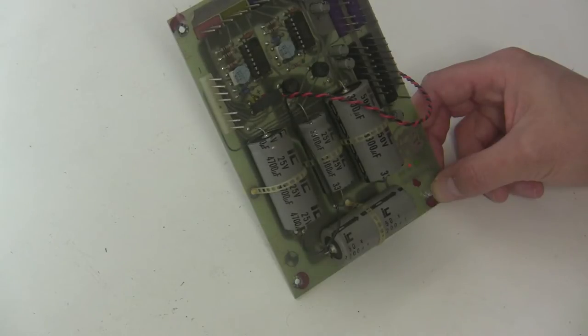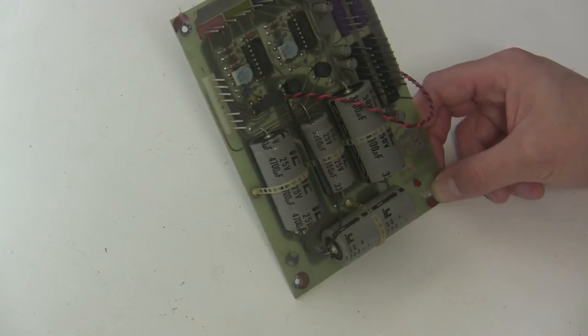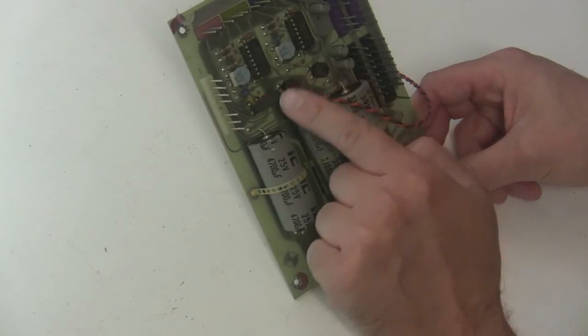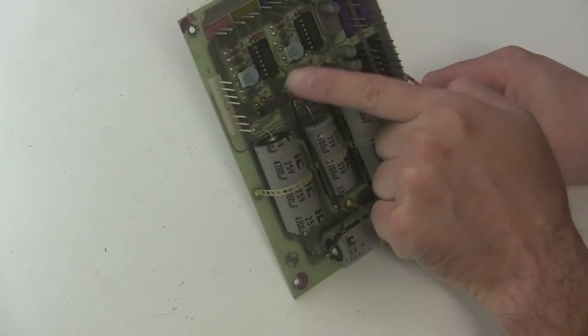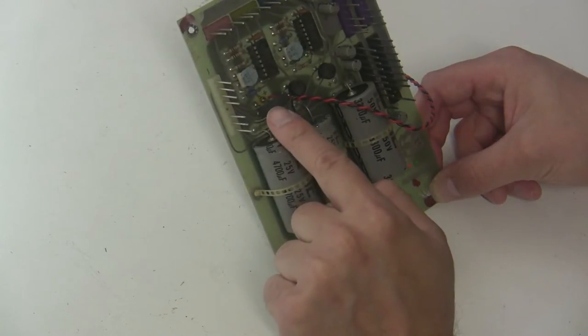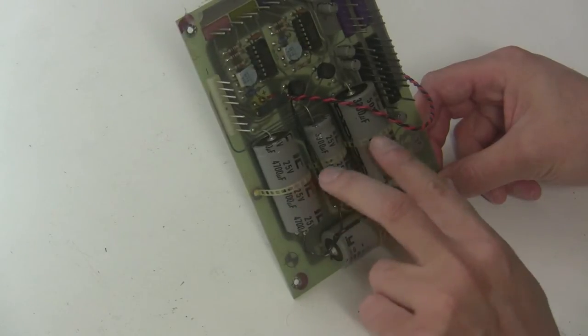I've measured some of them with a thermal camera — in particular the five-volt rail bridge running at about 140 to 150 degrees Celsius, while the part is only rated for about 120 degrees Celsius. So by upgrading the bridge rectifier you take a lot of heat off it and it'll last longer. I sell a recap kit for the OB-XA that includes all the capacitors and bridge rectifiers. We're going to replace these two bridges — changing from one-amp to two-amp bridge rectifiers. And even though someone already replaced the five-volt bridge, we're still going to replace it with the six-amp bridge rectifier from my kit, which should take a lot of the heat off and make it last longer.